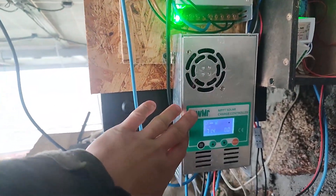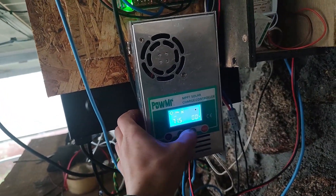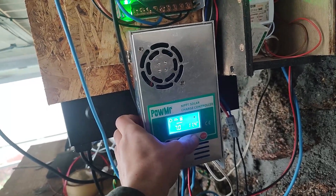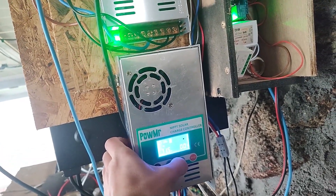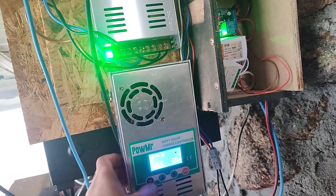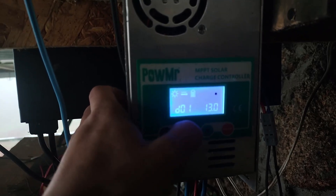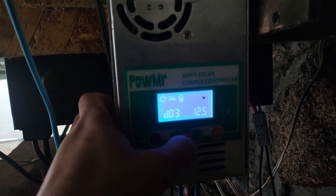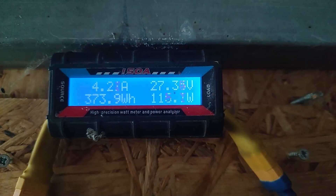This one is almost never used because I set the voltage — let me see — 13 volts. So 13 times 2 is 26 volts. And since I'm always higher than that with the hydro, basically four panels are not used unless I apply a very big load, because this one charges the battery first.